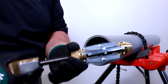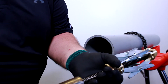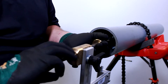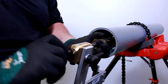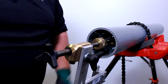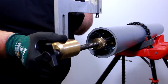Inserting our peeler into the pipe, our arms spread out in the ID of the pipe to support our tool. We turn our handle in the back to make our arms extend, so we'll go inside the pipe, leaving our grip just outside. Tighten our handle, and you'll see on the inside our arms that are supporting the peeler. Then we want to use our button here that allows our scraper to slide back and forth.